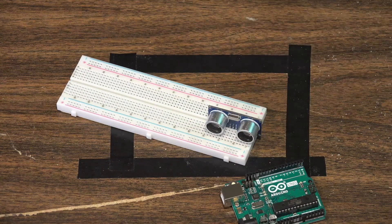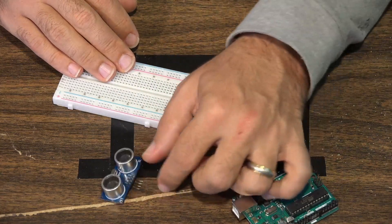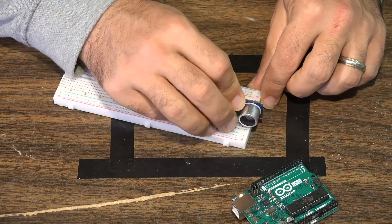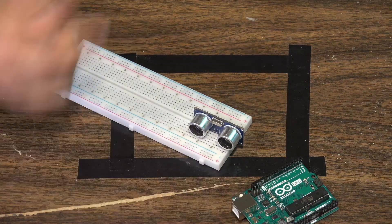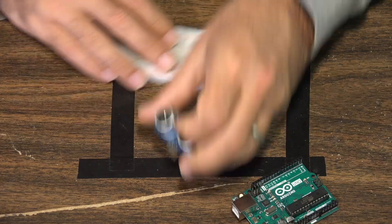One of the things I like about the breadboard is that I can put the sensor directly into it and it actually gives you a stand. When you're doing these projects, you're going to run into little problems such as how do you get it to stand up. With the breadboard, you can simply slot the sensor directly in and now not only can you wire to it, but you've got a stand so you can work with the sensor more easily.